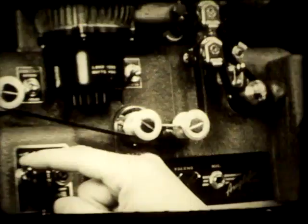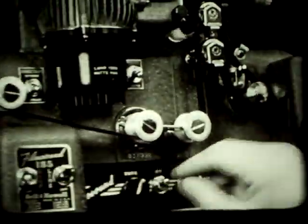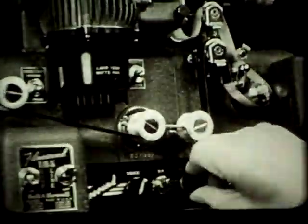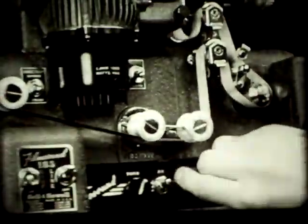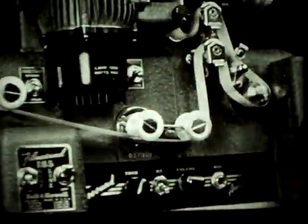When the film reaches its final fade-out, darken the screen by snapping off the lamp switch. As the sound ends, turn the volume low. Put the amplifier switch at the off position if no more sound films are to be shown at this time.